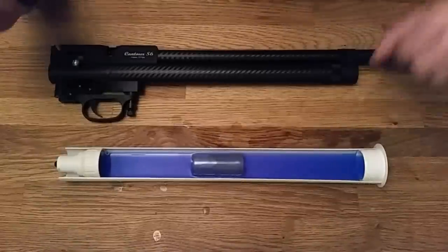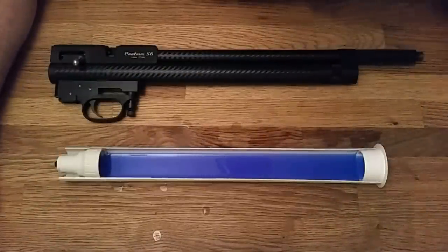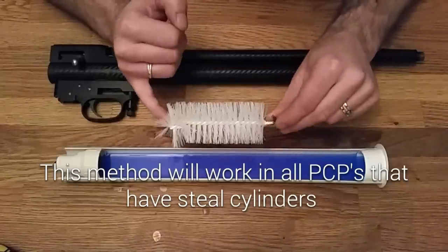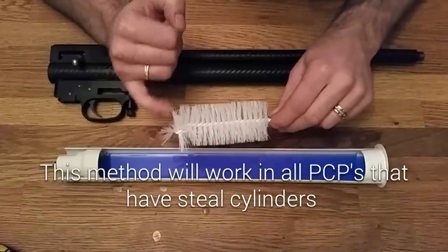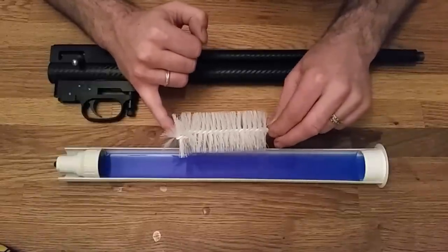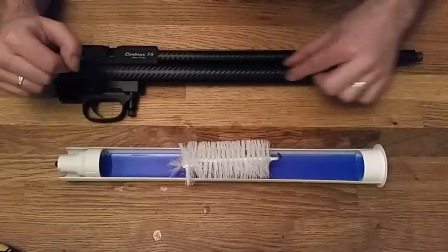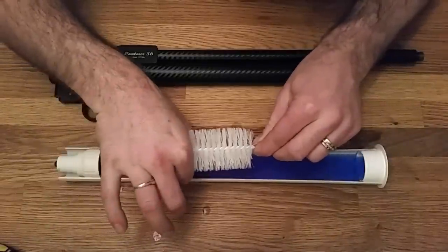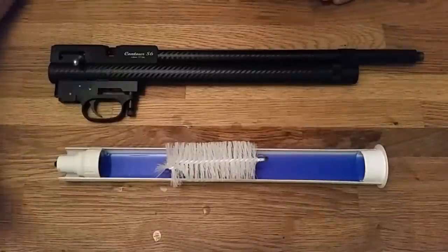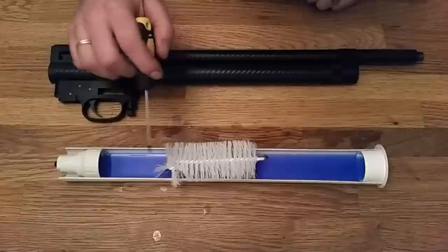Now the best method that I use, which is so simple and cheap, is a baby bottle brush. These are light as a feather and cheap as chips — I think this one is about 85p from Wilkinson. They are so easy to install, take up no volume whatsoever, stay put, and are easy to get out. This will sit roughly halfway inside the cylinder. When it's forced through, the bristles will move back and compress themselves, holding it in place. When the hammer strikes the valve the pressure wave will travel up and be completely absorbed and eliminated by the bristles.